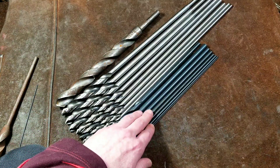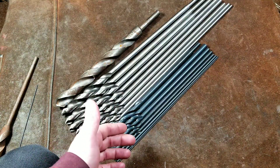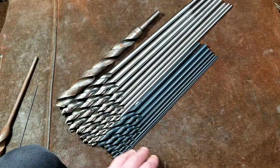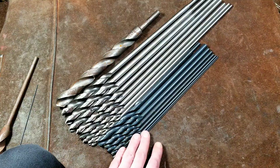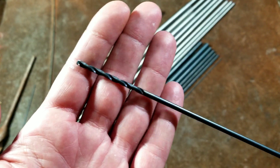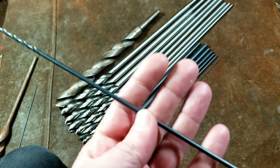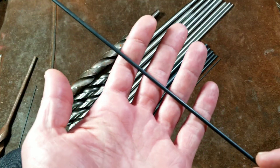Installing networks — and then we have what are known as aircraft drills. These are foot-long high-speed steel twist drills for metal drilling or any kind of drilling. These can of course be used for general purposes, but as they say, these are aircraft drills. They are 12 inches long and therefore offer extra long reach for metal drilling operations. But you can use them for anything, and that's really where aircraft use is where you do see these.